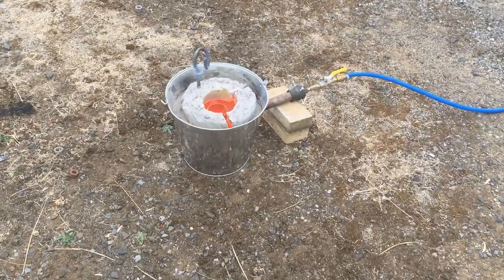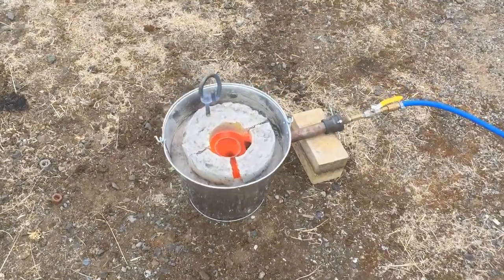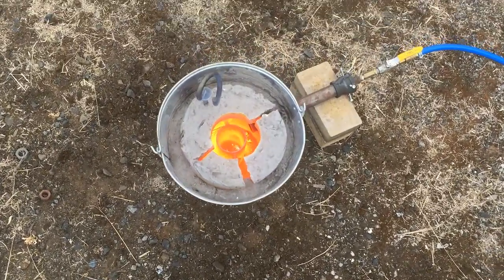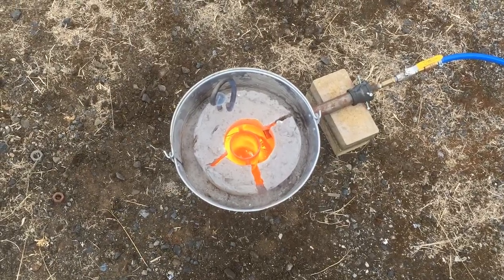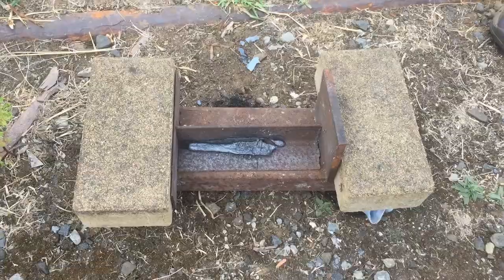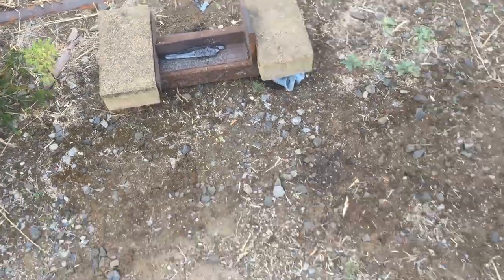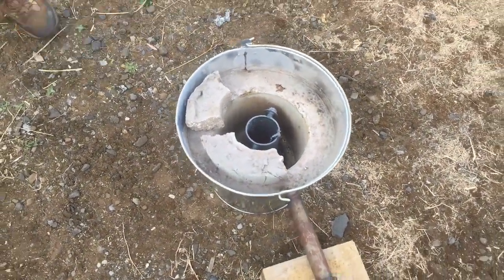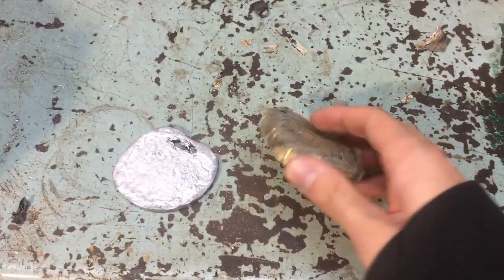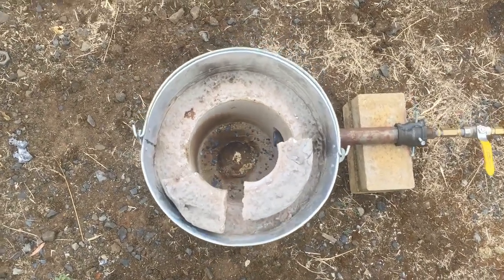Now we're going to have a go at seeing if we can melt copper. We've got some copper in the crucible — we don't really expect it to melt, but it'd be really nice if it did. It seems like it has actually melted the copper — you can see some shiny stuff at the bottom. After pouring it out, it looks a bit black, but that's all the copper we managed to melt. That means our furnace can actually reach over 1100 degrees — awesome. So there we have it — we're able to melt aluminium, brass, and copper with the furnace. I think that is a big success. See you later.